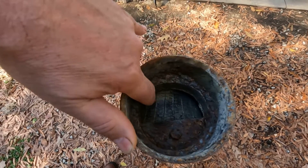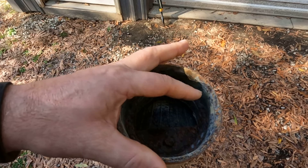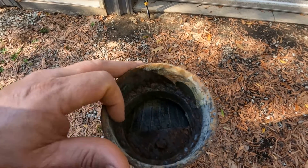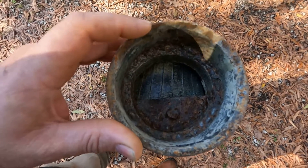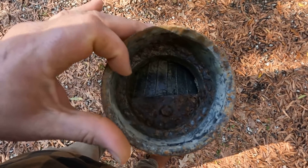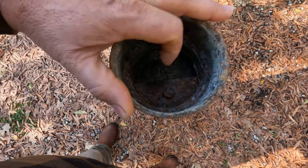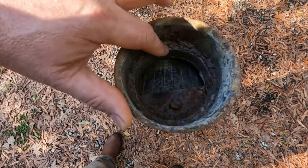So this next part right here — this little metal sleeve — what I did was I cut off about an inch of the pipe and cut it in two. I cut enough metal off so when I drop it down in here, it would fit and I could weld it in place. But before I did that, I had to make a plate right here. This metal plate is made out of one-eighth-inch flat metal. But if I had to do it again, I'd use at least three-sixteenths or a quarter-inch steel right here, because you can see it bending a little bit over time from driving down in the hole and hitting the clay. So what I did there — I just cut about half the diameter of that right there and welded that piece of metal on top of that ring.